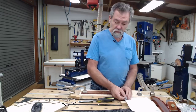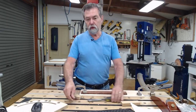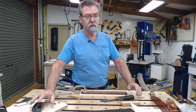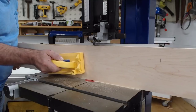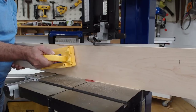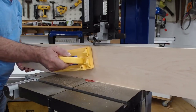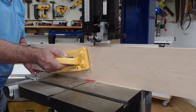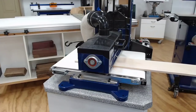All right, so the first thing, as I said, the jointer fence. I'll run you through a little bit of what I've done. I've got some video here. I'll put the specs on to see the screen a little easier. There's no sound in this. This is when I was ripping this rock maple on the bandsaw, and that's just a little 3/8 blade in there. I might get a better blade for that bandsaw. This is the one that just came stock on the machine, and whilst it's doing an okay job, it's making the machine work a little harder than it really needed to.